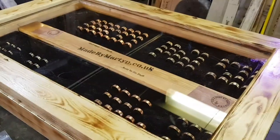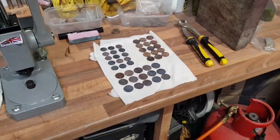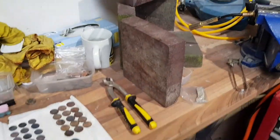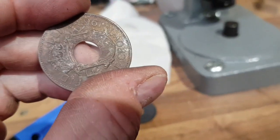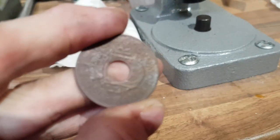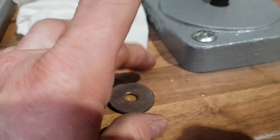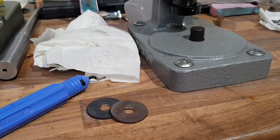I haven't got any coins ready-made. I'm doing some shillings, sixpences and penny bits at the moment. I'll have to pause and knock up a couple of half crowns, then be right back. I should note I've put a slightly smaller hole in a half crown than I would normally, as this is a test to make a wider band. I'd normally put a slightly larger hole in there, so let's see what that turns out like when it's stretched and formed.